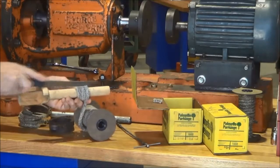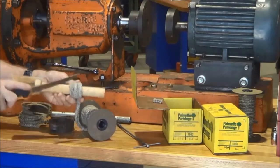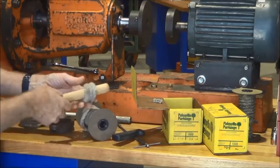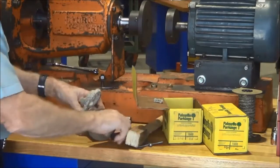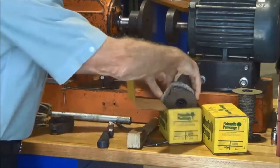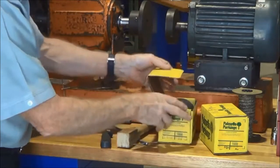We do a nice straight cut. For a pump, we want a straight cut. For valves, 45 degrees like that. A good sharp packing knife is required, so you get a nice neat cut on the ends of the packing rounds.